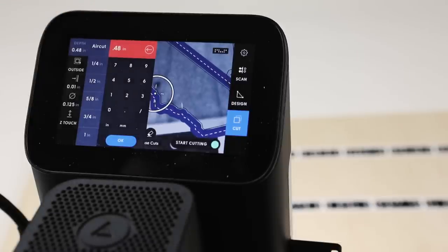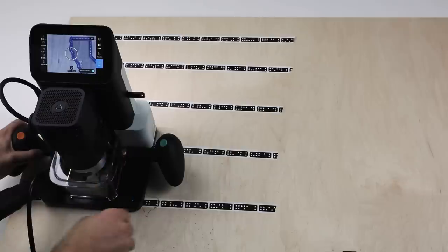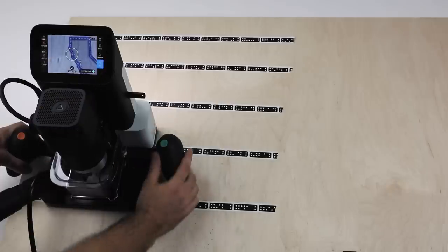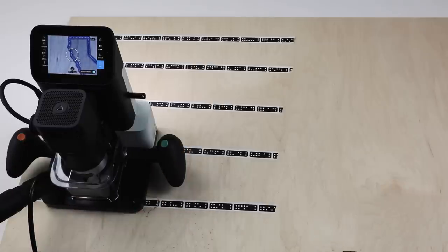So if this is 1/2 inch, we're going to leave a little skin on the bottom. That will enable our finishing pass to cut through that, and that will make it a very low resistance cut. There'll be very little forces present when we cut the final pass, because there'll be no material. We're cutting minimal material below and removing that tiny little offset we added. So this will be a roughing pass, leaving a skin on the bottom. And for our finishing pass, we'll be removing a very small amount of material on the sides and straight down. So the whole system will not be loaded up. It won't be under load when we're cutting. So we should be able to get a very clean, accurate cut to finish with.